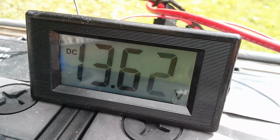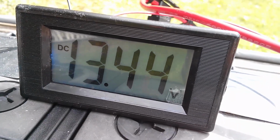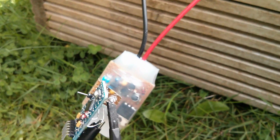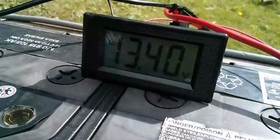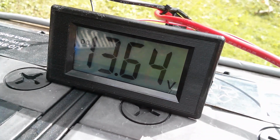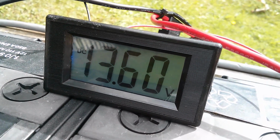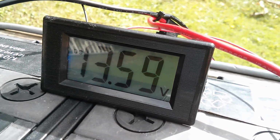with no load. Let's have a look at the overshoot on the digital meter. Switch the lamp on. Okay, the lamp's on. That's pulling the battery voltage down a bit, and that's probably because of resistance in these black and red wires, so that we're getting a slightly lower voltage visible on the controller. Or would it be lower or higher? Anyway, that's what's causing that. Now let's look at the overshoot. Switch the bulb off. So it only shot up to 6.3 and then settles back at 6.0. So I think that's solved the overshoot problem, even if some problems still remain.